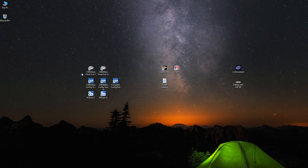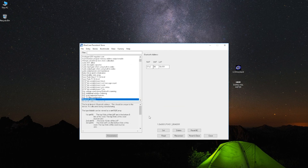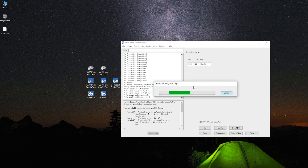Once you've connected the wires, go into PS Tool — the device should be detected. Click OK and you'll get to the main page; otherwise it'll say 'error reading chip,' which means you either connected the wires wrong or haven't properly entered programming mode. The first thing you want to do is hit Dump and save it — give it a name.